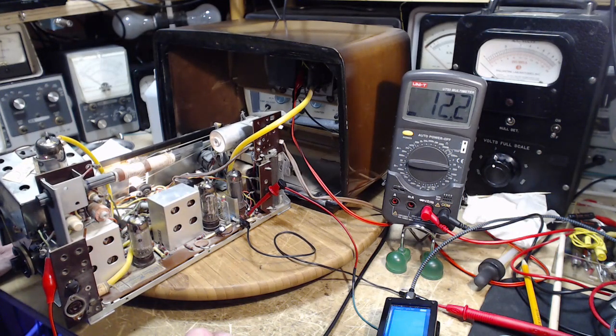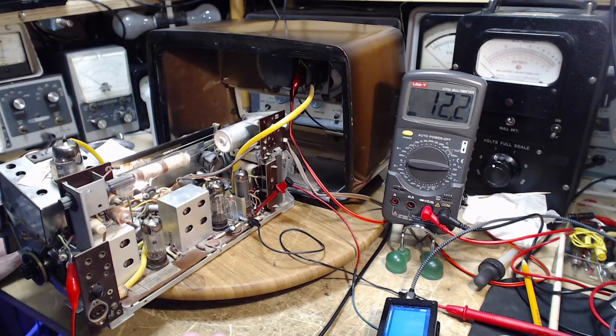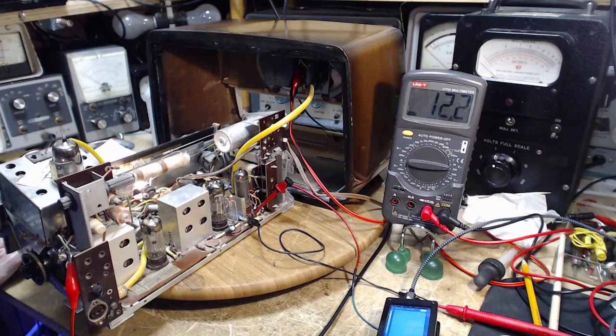So you're not supposed to be able to do this. Just pop a 6AQ5 in successfully where one of those other tubes was, but there it is. So I think we've kind of jumped right past the problem here. We've got lots of volume now. The distortion's gone. Thumbs up on that. Okay, great.